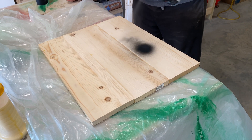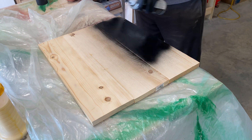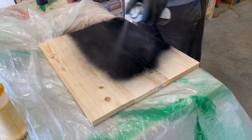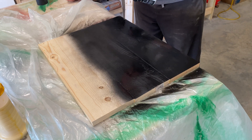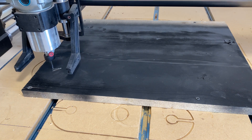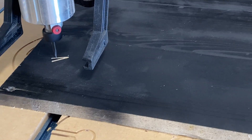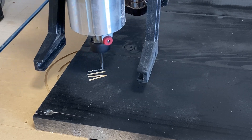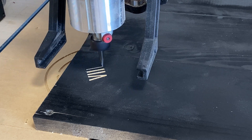To start off with, once I had joined up some wood, I just used some black spray paint because I'm going to paint the surface and then cut out everything except what I'd like to. Always make sure that the paint dries before you actually start your cut or you can end up really messing it up. From there, let's go ahead and move to the Onefinity CNC. I'm speeding up much of this because I still like to show it off, but you don't want to sit there for a half an hour and watch everything go. In this situation, I actually screwed down the wood with wood screws, but a lot of the time I'll use CA glue and tape and I kind of like that better.